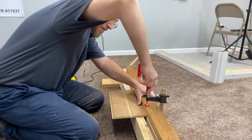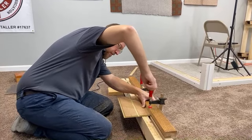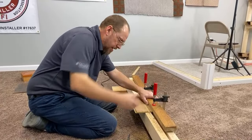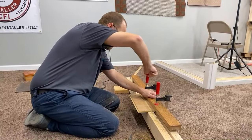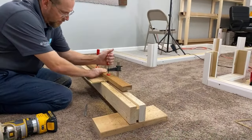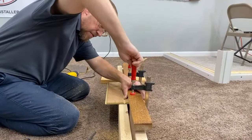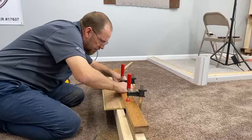I want to readjust my board and get it on the other mark. I'm just doing this on small pieces so you can get the idea — you can make yourself a little jig to do this. The jig I've got is four feet long, which will cover about 99% of all your steps. I'm getting right on my mark dead-on. Be careful not to mess up when showing somebody how to do it — that would be funny.